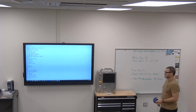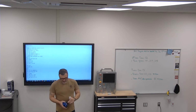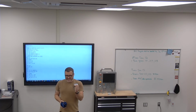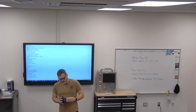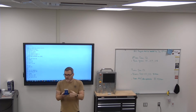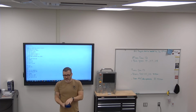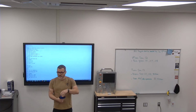So our next 2nd 8 weeks, I want to primarily use this as our holding method. So you'll still use the vise some, but you'll make blanks like this. You put them in here like this. And then you tighten these 2 bolts in there, okay? So this has a locating diameter on the table. So once it knows where it's at, once you set this, all your parts will always go into this exact same spot. Same X, same Y, same Z, always. So once they're in there, they've got a pin that goes in here too for orientation this way.